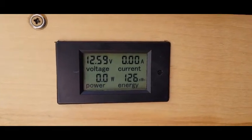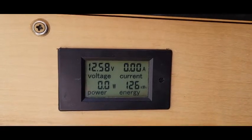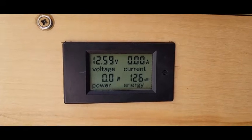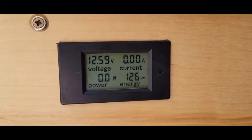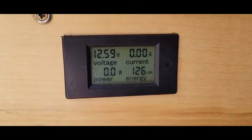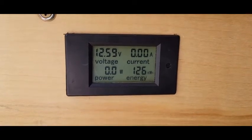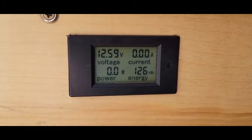We also added this inexpensive little battery monitor. We really just use the voltage on the upper left and the current or amps on the upper right. This is valuable in knowing how low your battery is — I don't know how you would maintain a decent battery life without knowing what the voltage is. The current or amps is also valuable to decide if you need solar and how much solar you need. We'll measure the amp loadings in our camper in this video.